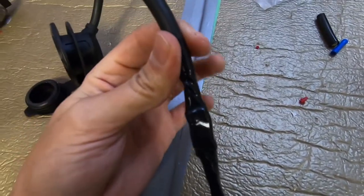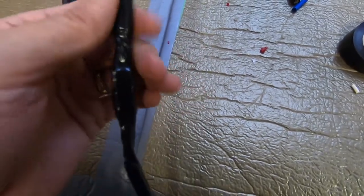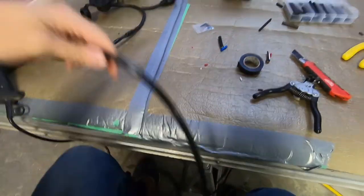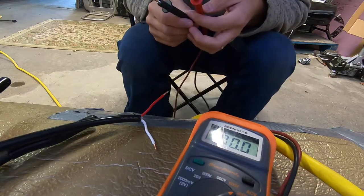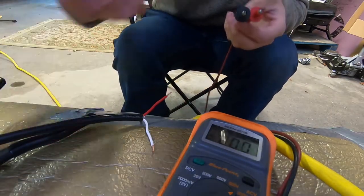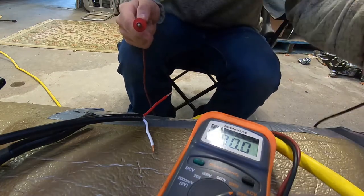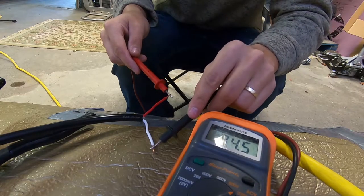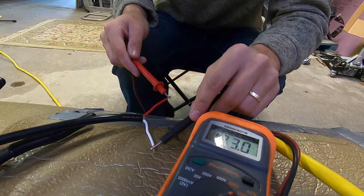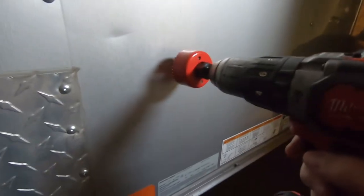That's the splice all nice and tidied up. I finished with some electrical tape and heat shrunk each individual wire so there's no possibility of moisture getting in there — that's a nice solid connection. Basically I just extended the wire an extra three feet, so essentially this is just an extension cord now. I'm not an electrician and I don't warranty any of my work or suggest you try this at home, but I just have an extension cord plugged in with exposed wires at the other end to verify I got the wires right. I'm reading 120 volts — 122, 123 — so that's perfect.